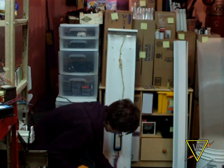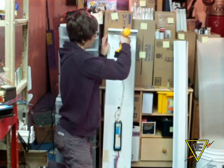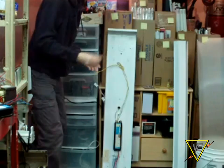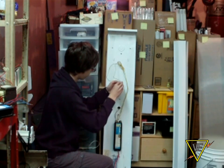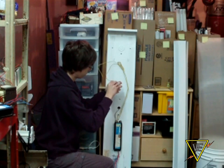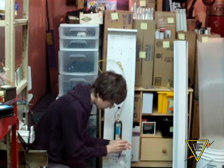Removing the lamp holders is usually easy to do. Unscrew the brackets to which the lamp holders are either bolted or just clipped. Then, my personal tip: take a paper clip, unbend it, and insert it in the holes where the wires are connected. Then pull the wires out of the hole. The paper clip should come off easily as well, because the lamp holder can hold copper wires but not steel wires — they're too hard. That's the secret.